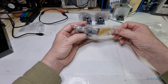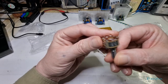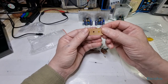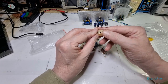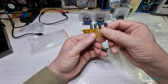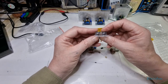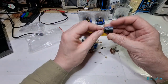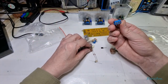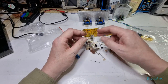I feel quite good about building this. Let me take a peek at the components and see if they're any good. It doesn't feel particularly crusty. We've got some polymer capacitors — they're electrolytics but polymer type. There are also some Nichicon caps, which is nice — at least we're starting off in the right area. There are standard connector blocks and some more polymers, plus a bunch of carbon resistors.